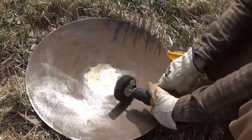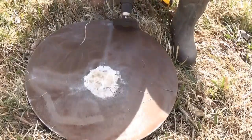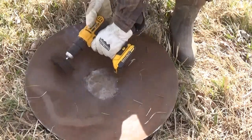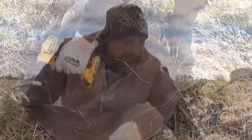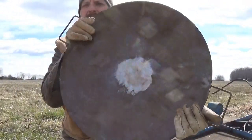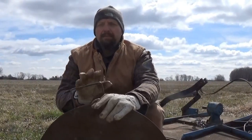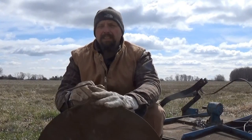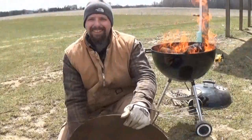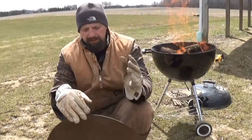What I've got here is like a paint and rust stripper. I couldn't find it as a grinder attachment so I had to chuck it up in a drill. That stripper did a really nice job — hopefully you can see how well it polished up. It's not a shiny polish, but if you spend more time on it you'll get better results. I'm going to go ahead and hit the stripper against the exterior too, give it a nice polish on the outside, and then we're going to throw it in the fire to burn the contaminants and rust out of the steel.